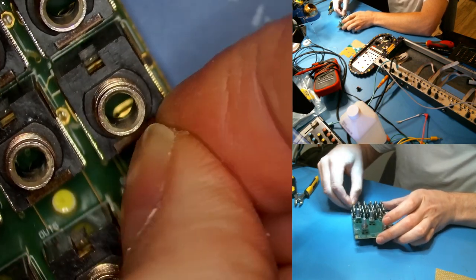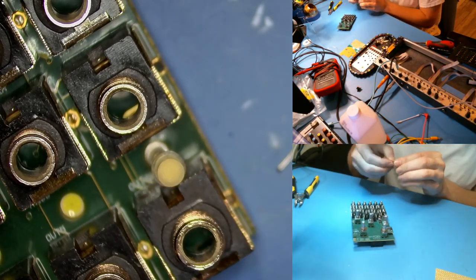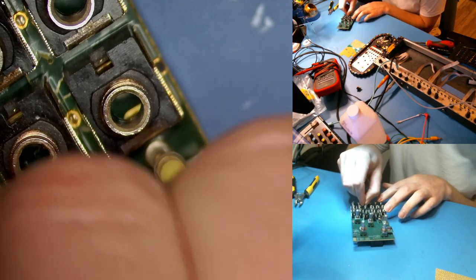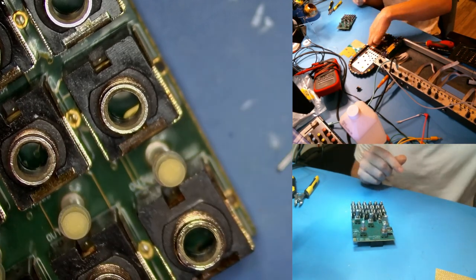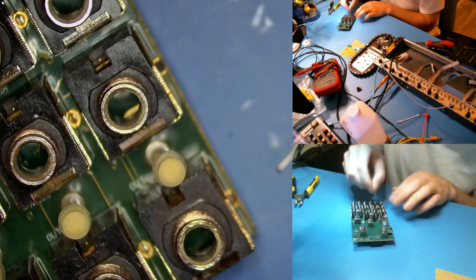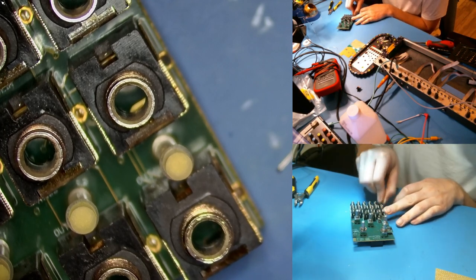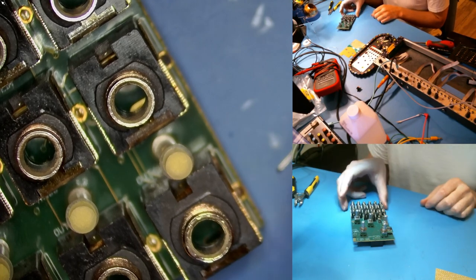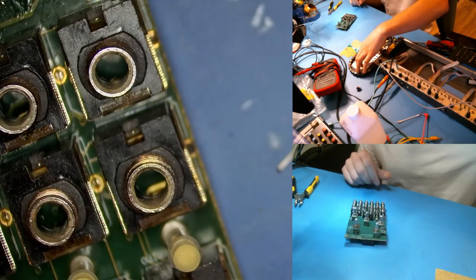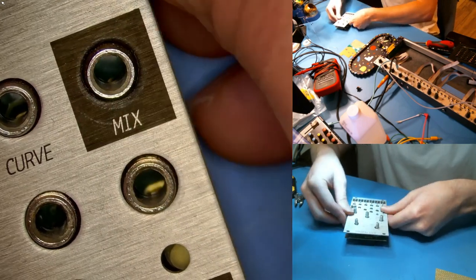On these original ones you basically have to get the pipe into a hole on the circuit board — the LEDs are soldered on the back of the PCB and there are just holes in the circuit board. What you're doing right here is pushing the lens down to touch the LED. You don't want to push too hard because you can pop the LED off the back — just get it lined up and it should press into the hole. They're all on now, but the challenge is they all move.